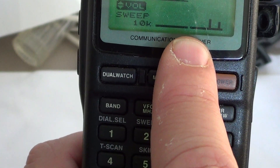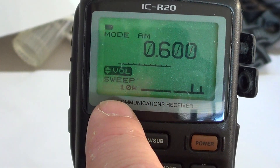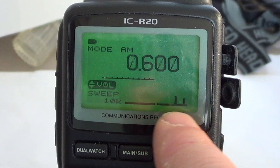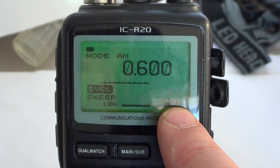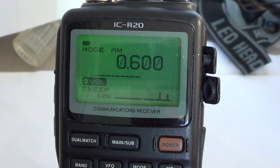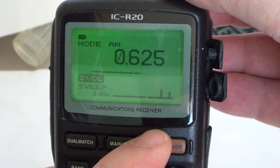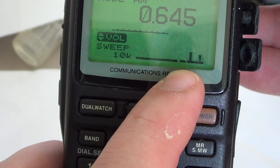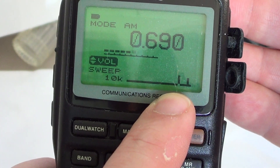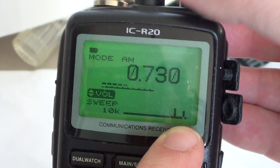There's a little white dot — it's not easy to see but it's right there. What's below the white dot is lower in frequency and what's to the right is higher in frequency. I have two little spikes on the right side matching some medium-wave stations. I can take the tuning button and start tuning higher — you'll see the dot move on the display — and once you're under a spike, there's a station. I continue and hit the next spike.